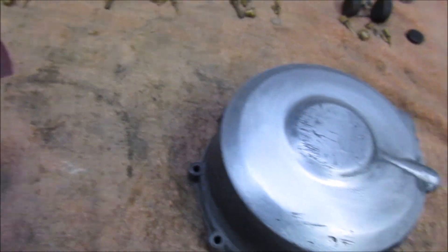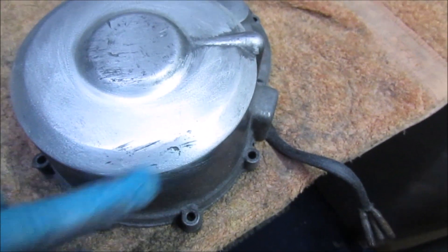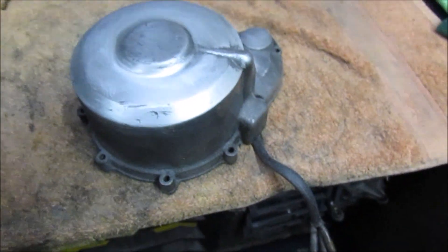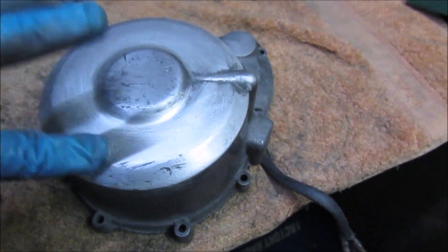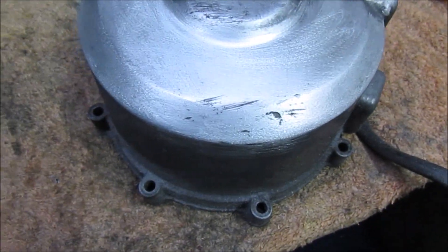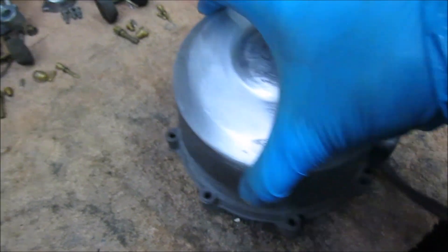It is just literally going through the grades — I'm down to 40 grit at the moment just to bring these deep scratches out, and then it will be coming up through the grades: 60, 80, 100, and so on, until you get up to about 1000, 1200, 1500 grit. I will actually use the scourers at one point. But that's what keeps me occupied behind the scenes — getting things ready.